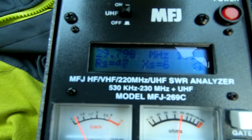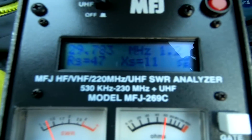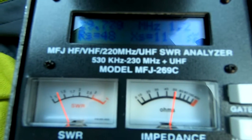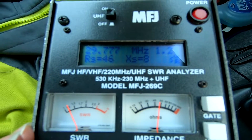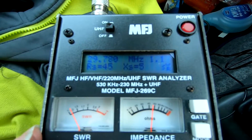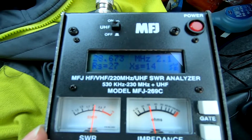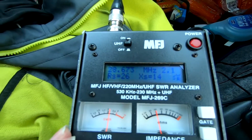I'm slightly shocked — look at that SWR! About 1.2, 1.3, 1.4. So I'm only going to be interested in the SSB to FM parts. The portion I'm going to try and use is 28.225 to 29.700.